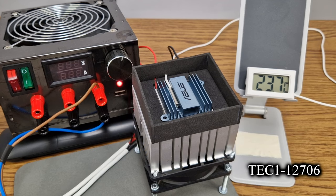I will power the Peltier module with my ATX power supply. At 12V it starts with a current consumption of 3.8A, which is slowly decreasing. These modules can be powered with up to 15V, which will result in higher current consumption. I will fast forward the video so you can see the temperature decreasing.